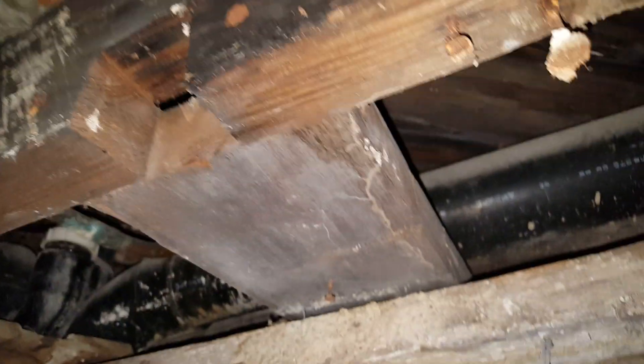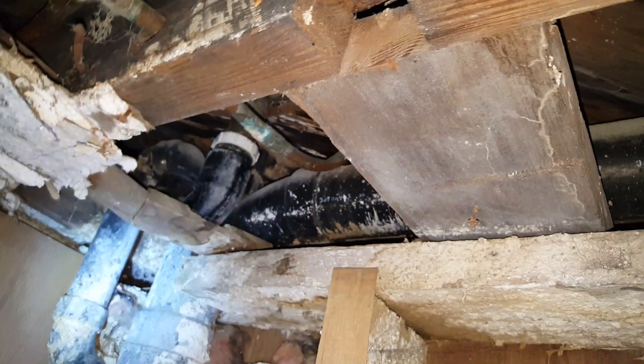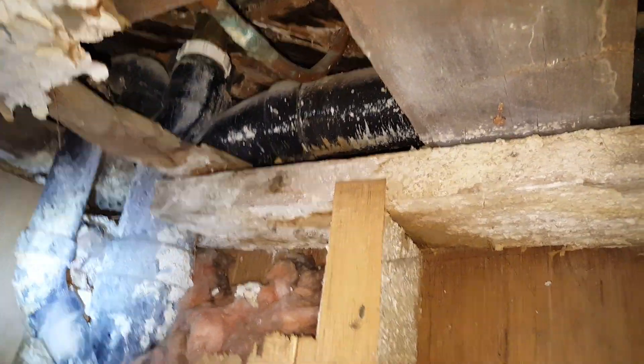And then you've got a new spot, a new piece of wood to secure your floor flange to, so that it don't rock and wiggle. Or that will be leaking next, because once it wiggles so much, it'll squeeze that wax out of the way, and then it'll go to pouring right there. But that's the main issue right there. I knew something had to be leaking by that calcium deposit right there.